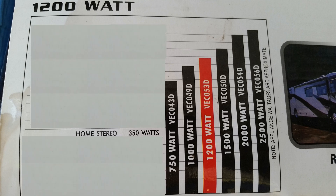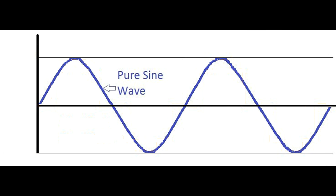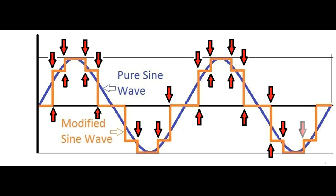The last thing I'd like to talk about is audio systems. You can see by this chart they claim you can use an inverter to drive a home stereo system. Well, the truth is: yes and no — it depends on how much you paid for your inverter. The electricity that comes out of your wall is a pure sine wave without any sharp changes in voltage or current. The more expensive inverters can actually reproduce this sine wave, so your audio equipment will work just fine. However, cheaper inverters don't produce a sine wave — they produce something called a modified sine wave. Instead of the voltage and current flowing smoothly, it jumps. Every place where you see a sharp change, electrical interference is generated, and you can hear the interference over an audio circuit. Unfortunately, since I use an inverter while making my videos, I have forgotten to turn the inverter off while doing the audio, and you can hear that hum in the background. So the quality of the inverter makes a big difference, and I apologize to any subscriber who had to listen to it.